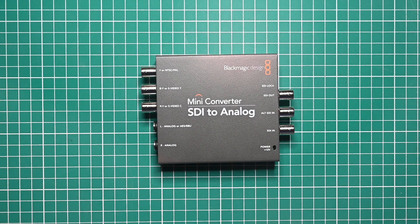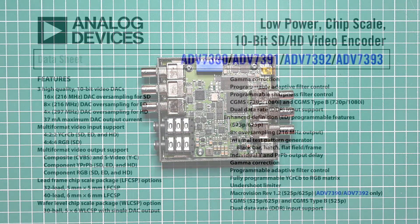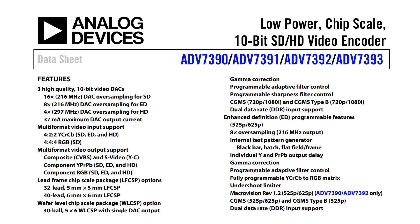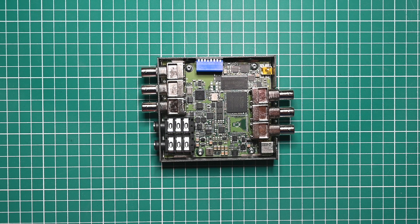This thing here just came through the mail slot this morning and I think it contains a pretty good starting point for this kind of project. Contained within it is an ADV7393 analog video encoder, which is current technology and only costs 13 bucks. I just did a quick performance test on it and it's really good and requires relatively few other components. So a fast microcontroller feeding a chip like this would probably be the best approach. I'm not sure if this is a project I would be able to tackle myself, but I'm going to link to any relevant information in the description.